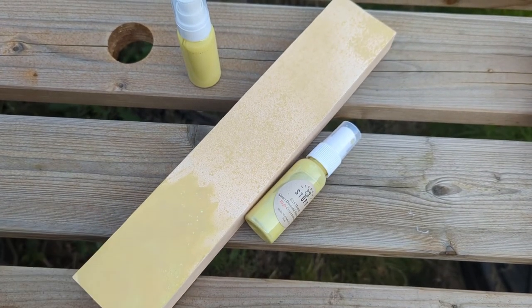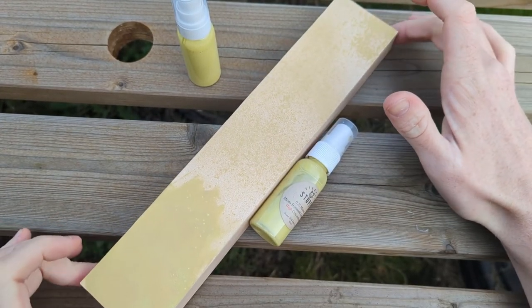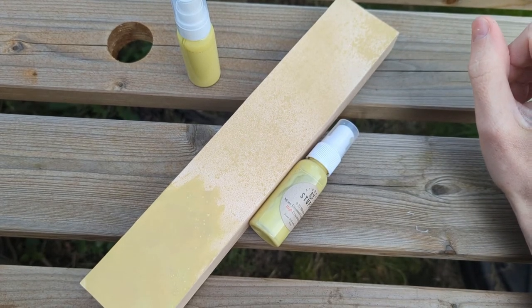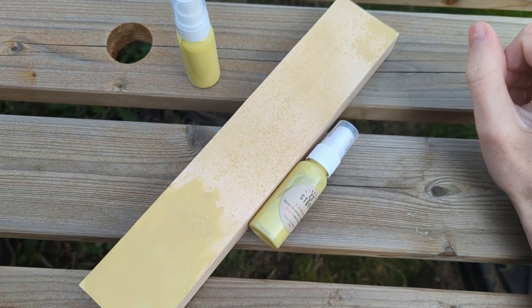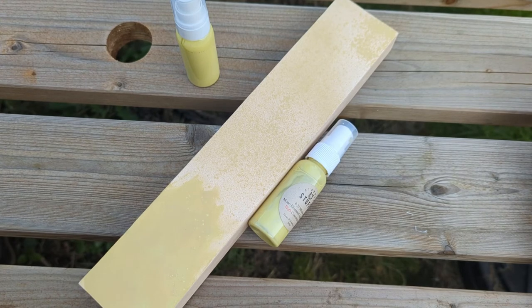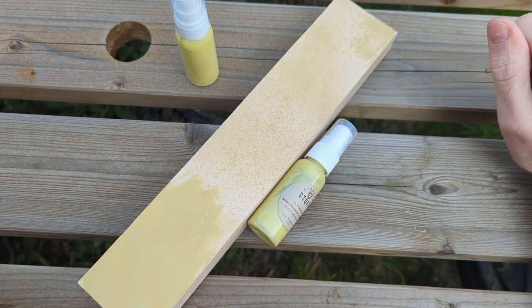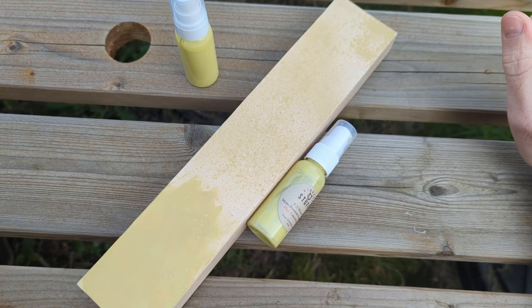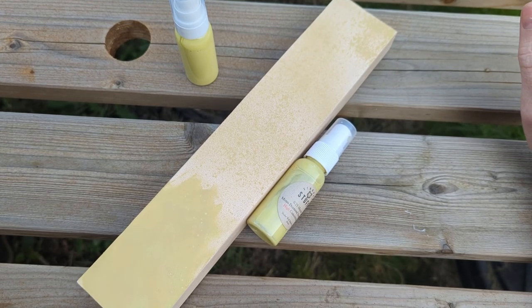Another really important thing I forgot to mention at the beginning: make sure that the surface of the strop is completely free of grit before you use it. If you bought one from a factory, hopefully there won't be any grit embedded in it, but if you made it yourself, you're very likely to have contaminated it when you were making it. With suede like this, I brush it with a stiff bristle brush a lot to try and get all of the grit out, and then I run my hand over it — you can actually feel bits of grit in there if there's any left. With a smooth, unfinished grain side leather, you generally won't get anything embedding into it and you can just wipe it off with your hand.